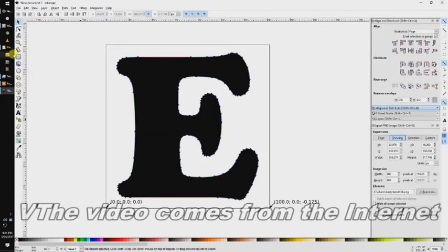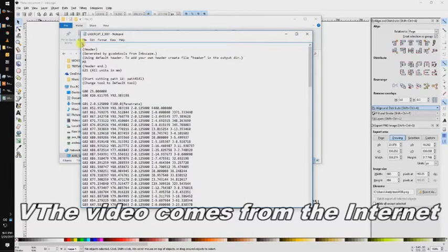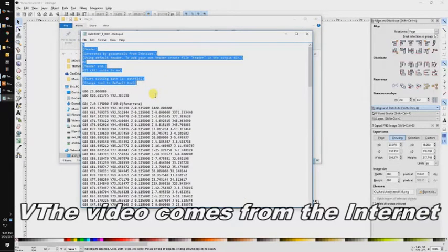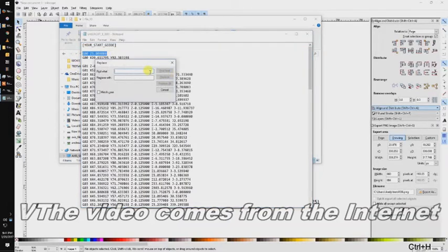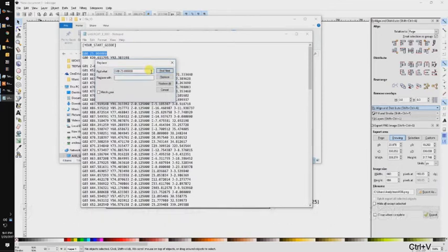Let's open our file and do some manual edits. Inkscape automatically creates some G-code for the start file. Keep it or replace it however you like. The G0 Z5 call is to bring the tool up, and in this case we want to turn the laser off. This code will be different depending on which kind of electronics you have and what firmware you're using.